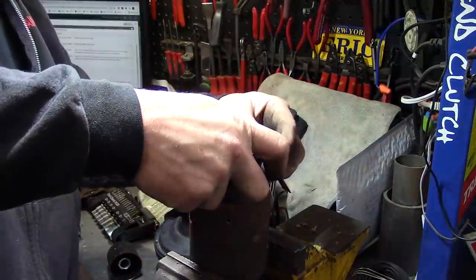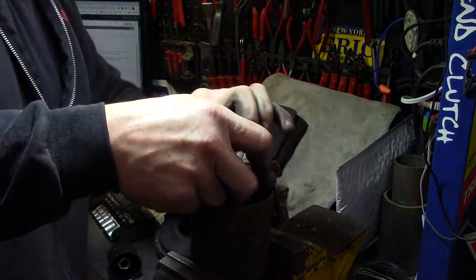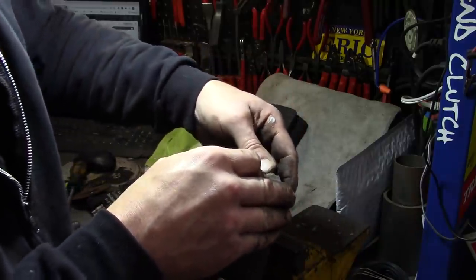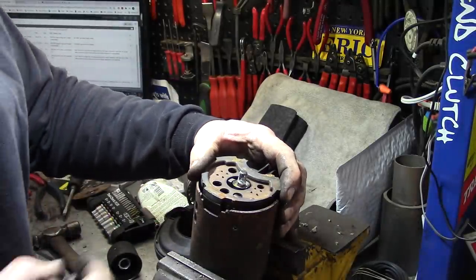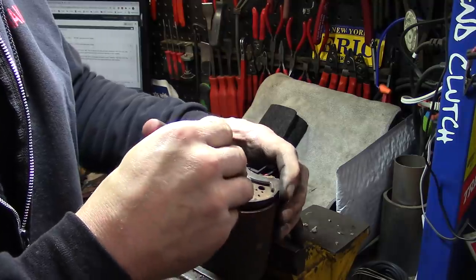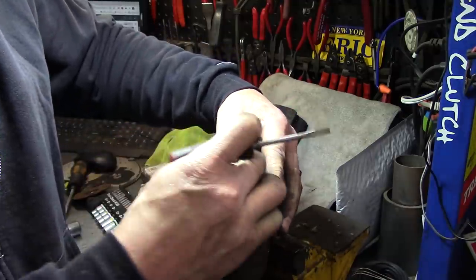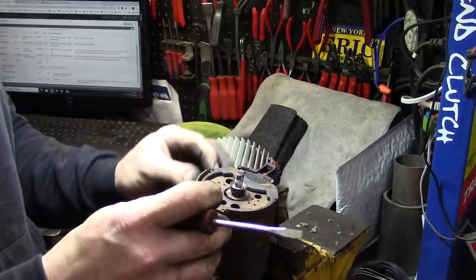I need to go to the vise. How do we go about getting our brushes down there? We'll get them kind of started like that. We'll use a little pocket screwdriver, perhaps — just kind of flick them back. Flick that one back, flick that one back. Almost had it. Coming down on the old commutator there. Hey, look at that — first try.